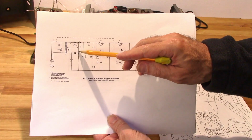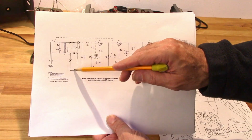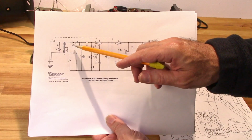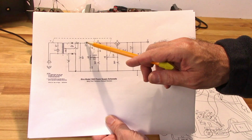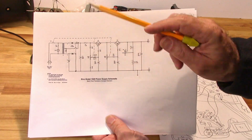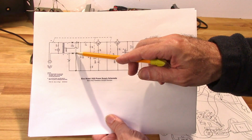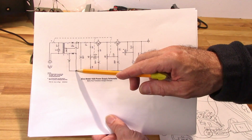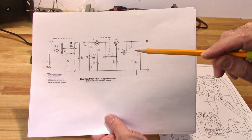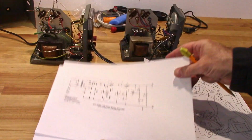First of all, this right here, that connection should not exist. The center tap comes off of here. It is connected to that fuse. There is also another 220 ohm resistor right here. So, with all that being said, if I bring this over to here, drop it down, turn those diodes around, it's all starting to make sense. That there goes away. So I wound up redrawing this,